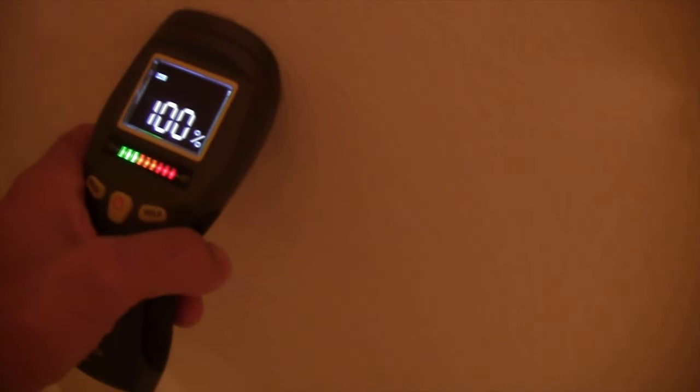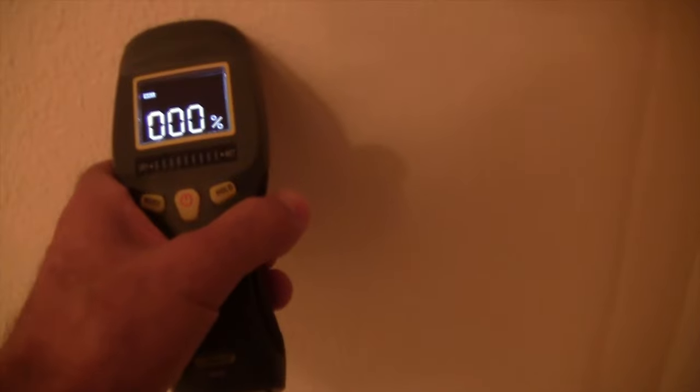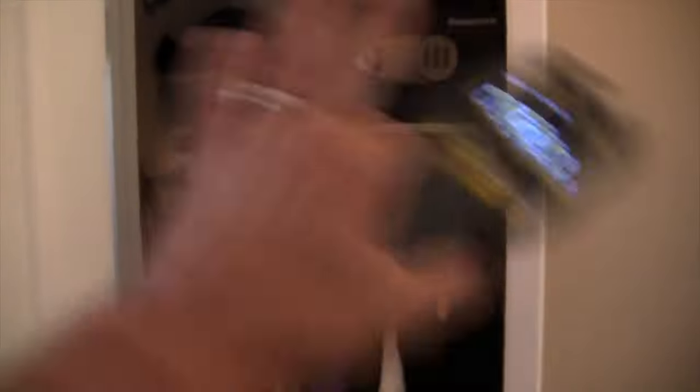Yikes — all of this is wet. I'm trying to prevent having to do a bunch of patch and paint on the visible side. What I need to do is get these closet walls opened up. I'm going to take all this stuff out of the closet, then make some holes in the wall so I can get some airflow going in. I'll do two holes — one on this wall and one on this wall over here — and also up at ceiling level I'm going to open it up to get a place for the airflow to come out. I'll do all this right now.